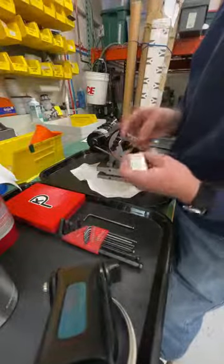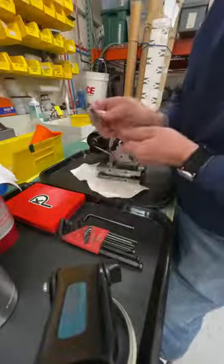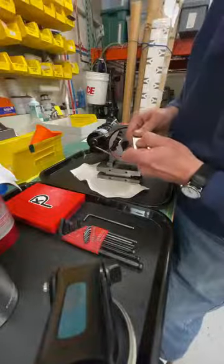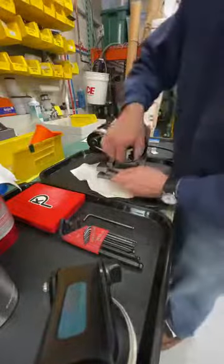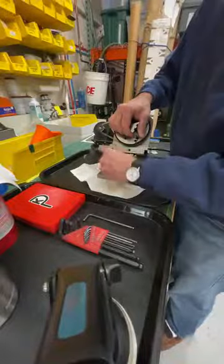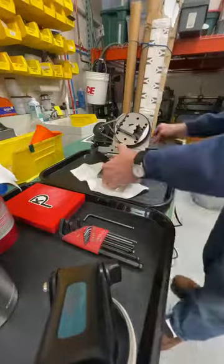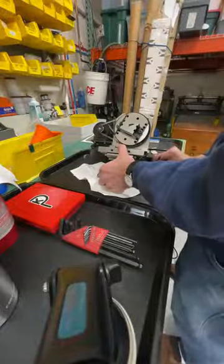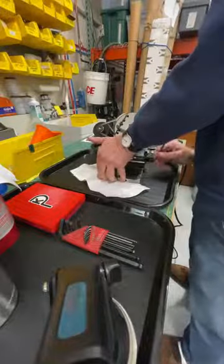But anyway. So we have a 2-inch gauge block and a 1/2-inch gauge block. And we're just going to wipe them and ring them. Okay. And they are nicely rung. All right, so there's your angle. And now I'm going to tighten up the screws. I like to push down while I'm tightening it.